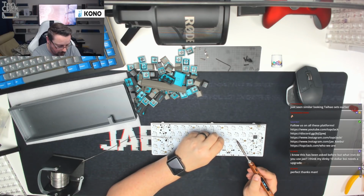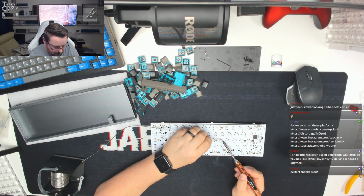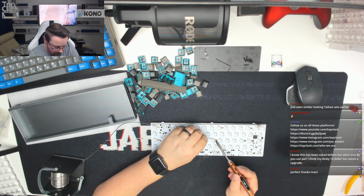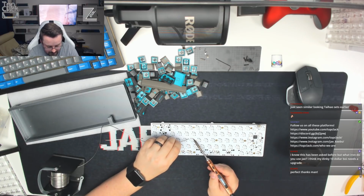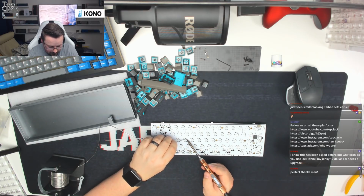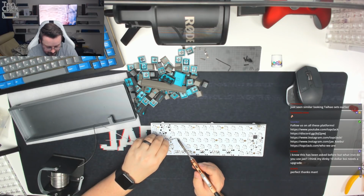It's USB firmware, so you can upgrade the firmware, have finer control over the temperature settings. It heats up instantly. It's not one that you need to wait for it to heat up. It's just super quick. And it's just really nice and easy to change the tips as well. I've got multiple tips depending on what work I'm doing. For this particular board, we're using the standard TSB2 tip. But if I'm doing things like SMD soldering work, which Pingu is doing on his stream earlier on, I'll tend to use one of the needle nose tips or one of the chisel tips. I used to use the chisel tips for LEDs, but I don't have a good clean chisel tip at the minute, so we'll be just using the standard round one for today.